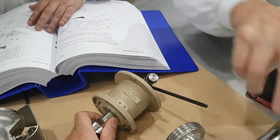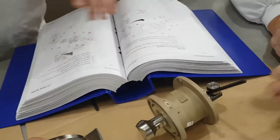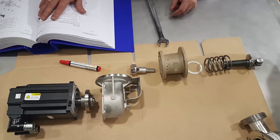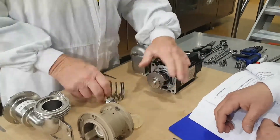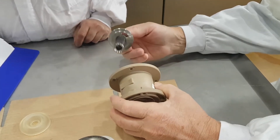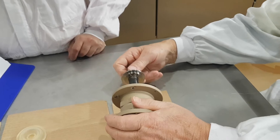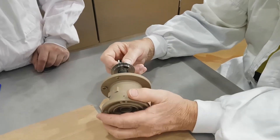So you hold here. Do we run this in heat sterilization? Very hot - 280. It's hot here. You can put grease on here, grease turns to glue, and then it's stuck. So not even a little bit - none, zero, negative, nothing. No grease. Clean. No grease.